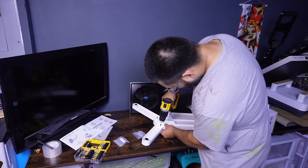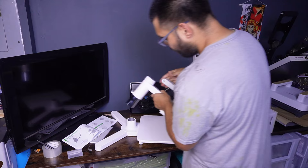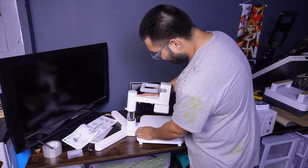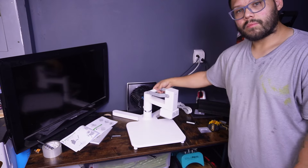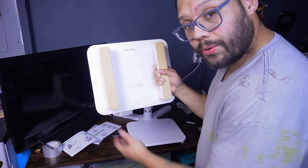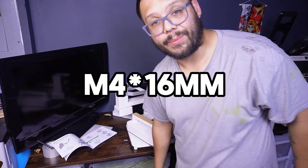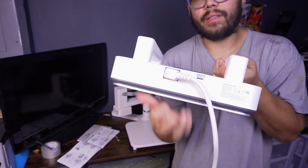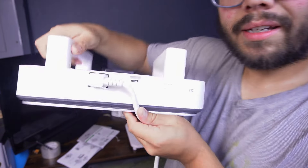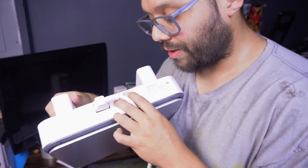First we got our feet — our M5 12 millimeters — and screw it on. Then we take our M5 14 millimeters and our control arm and just go ahead and stick this in here. We're going to screw it in from the bottom. Then we take our actual press, pop this little piece out, and replace it with the part I didn't know what it was for — it just goes right there. For this you use your M4 16 millimeters. Now we plug our power cord to the back right there. The press itself in the back has three different ports: the power port, a USB port, and this other port right here, which I'm not entirely sure what it does, but I'm pretty sure it has to do with this one right here.